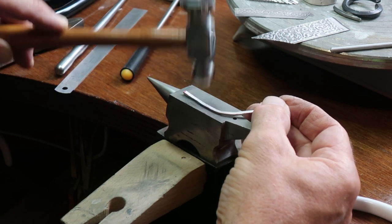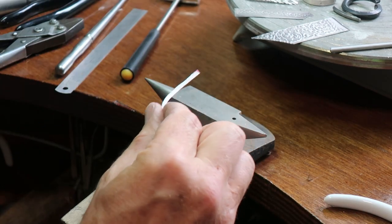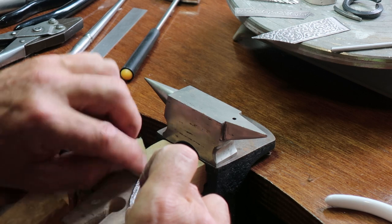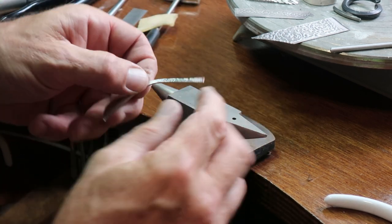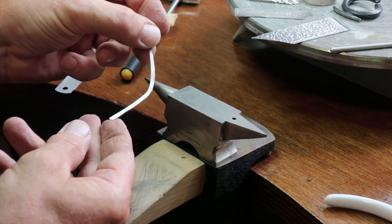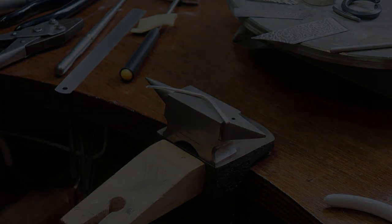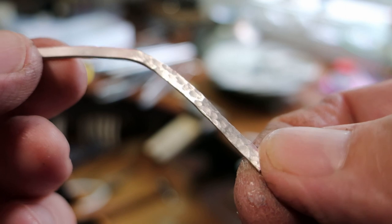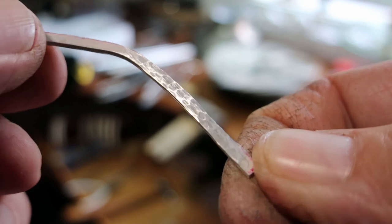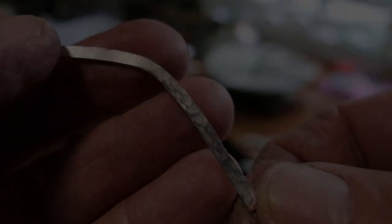Even with the fact that the tapping wasn't that loud, it's just the repetitiveness of it that actually started to get to me after a few days as well. But we give that a bit of a quick rub with some polishing sheet, and we'll give you a closeup on the texture of that. It gives a bit of extra kick, a bit of extra life to the surface, which reads really well on screen. Here's a closeup — you can see that peen texture, once polished up and aged, gives a really nice sheen.